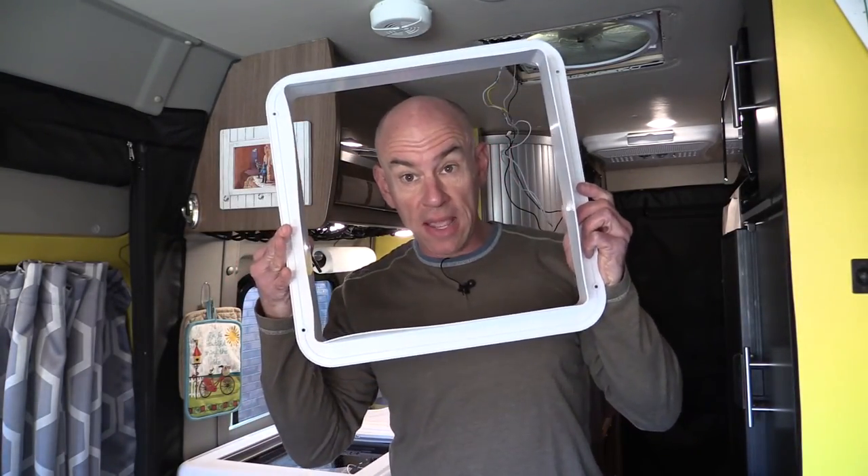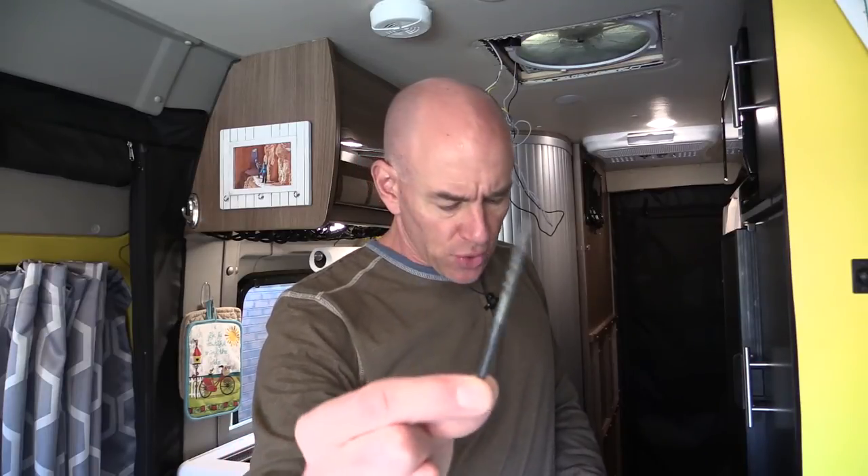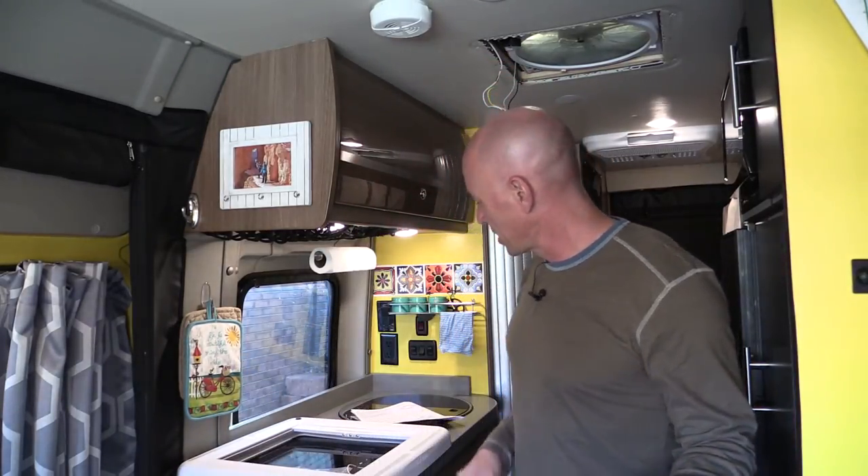Okay, hole drilled. Tip: since you do want to save this and not wreck it, be careful drilling the hole. Do not use a twist drill bit like this. If you try to drill thin plastic with a twist drill, it will grab and spin the plastic around in your hands, cut your hands, and break the plastic — I've done that. Instead, use a step drill. That worked great, just took the plastic right out. Step two done — though I did have to use an extra tool.